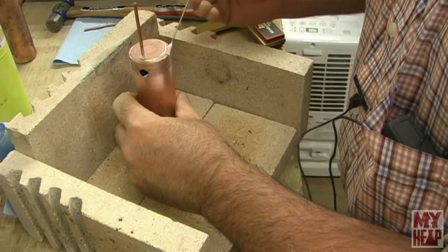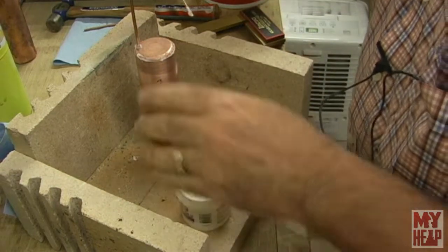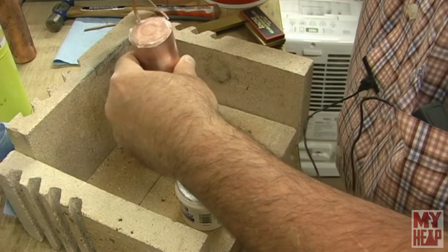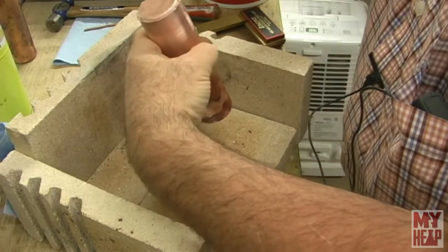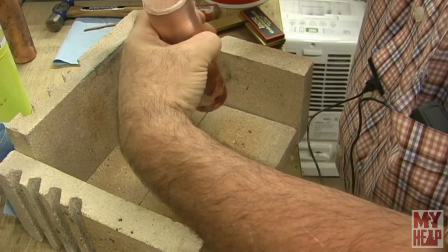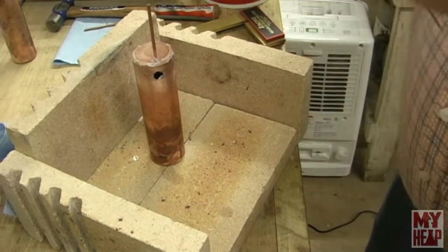Now the only thing I haven't put in is my boiler bush for the filler bush slash safety relief valve, right? Because I think it's just at a weird angle. So I'm going to get this here silver soldered up, and then I'll clean that area up, and then we'll solder that area up. So hopefully get this lined out here. And I probably should have done this off camera, but it is what it is. So let's fire our torch up and see what happens.